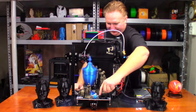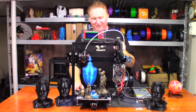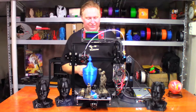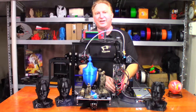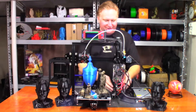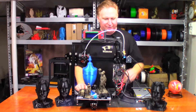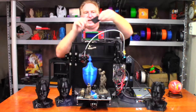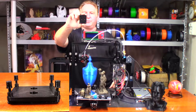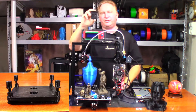While printing, I started smelling some burnt plastic smells, and from the horror stories I kind of knew what it was going to be. So I went ahead and ordered an external MOSFET — I'll put a link to the one I picked up on Amazon in the video description. I didn't want it just laying on the table or hanging around, so I went into Tinkercad and designed this bracket right here. It's an external MOSFET bracket that connects with two screws.